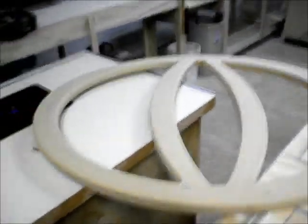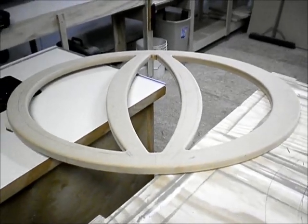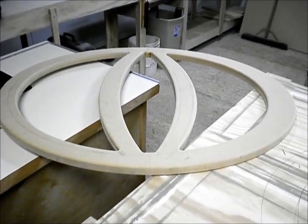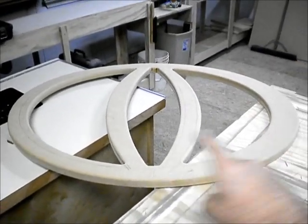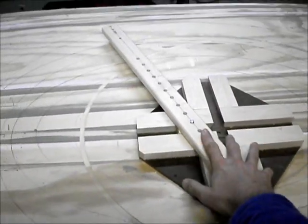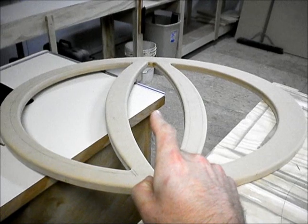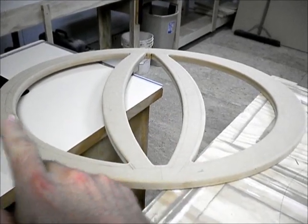This is the piece I was just trying to see what I could do with. I came up with this design — basically it's made up of four different ellipses. You see the outside one and the inside one, and it's a little bit wider on the right side than the left. I mounted the plate right to the center, found the cross hairs and center of the piece, and to get the outside radius and inside one, I moved it over a half inch, which made that smaller and that bigger.